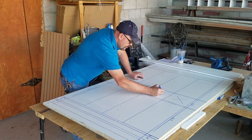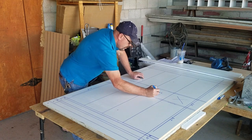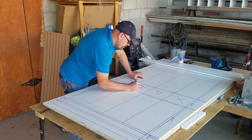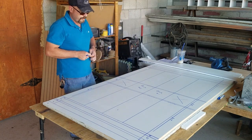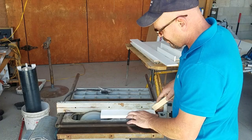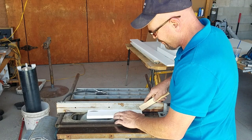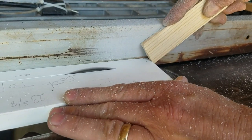And there I'm just Xing out the ones that won't be poured and won't be used, and which ones are the backs of the two fireboxes that I'm building in this form here. I'm making this form out of a press board with melamine laminated to it because it's cheap. I am using a foam core vinyl board to make the other form pieces.